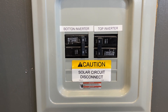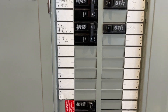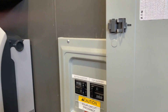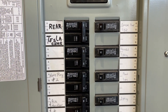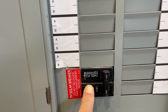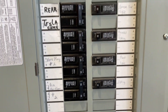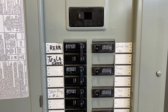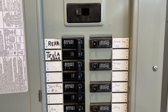This is the disconnect where I can disconnect each one of those string inverters. All of the power from the inverter flows into this circuit breaker, which is hooked in parallel with the 200 amp breaker that feeds my garage. The energy coming from solar comes through this 100 amp circuit breaker and powers the inside, which is actually connected to the grid. The grid then gets the remainder of energy that I do not use here in the garage, and that's calculated with the meter outside.